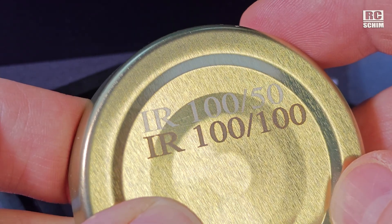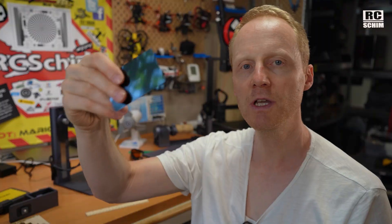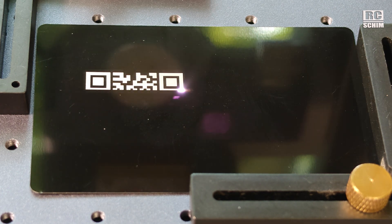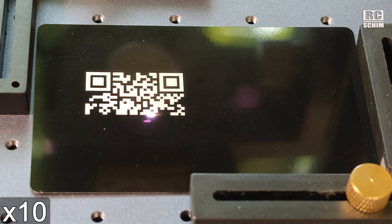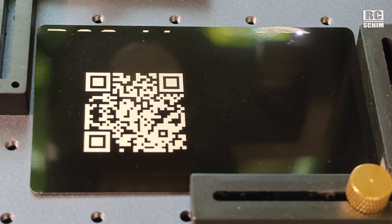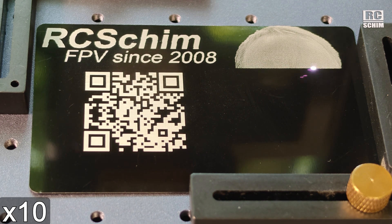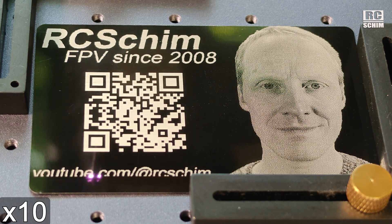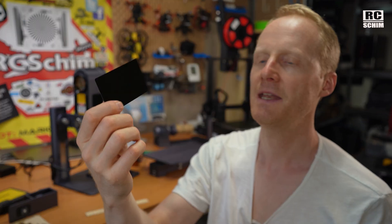In direct light it may be better to read, but in some reflective scenarios the white engraving actually looks clearer. You get five aluminum oxide business cards — they are black, but if you burn away the first layer it becomes white or grey. This is at 100% power and 83% depth for a QR code. I inverted the picture, which is important when lasering on a black object to shoot away the black color.